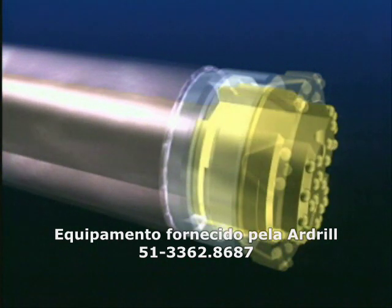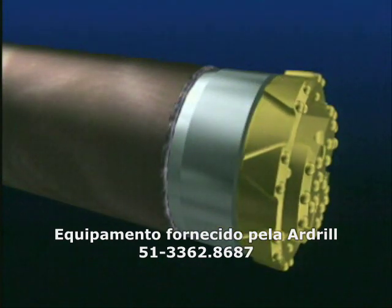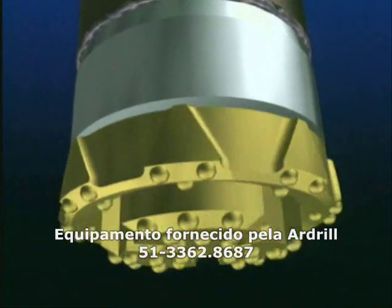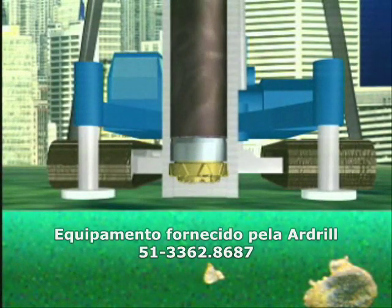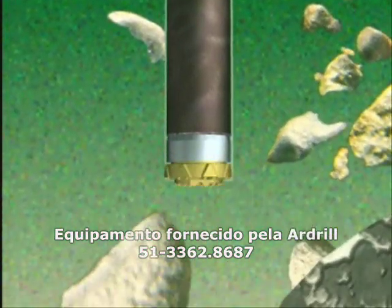The pilot bit is attached to the ring bit with a small clockwise turn. Locked together by a bayonet coupling, the pilot bit and ring bit drill a symmetrical hole which is sufficiently large to allow the casing shoe to pull down the casing pipe. This concentric Symmetrix method ensures fast drilling of straight holes with low torque.